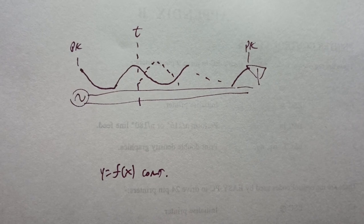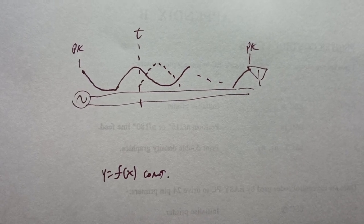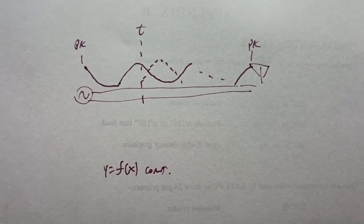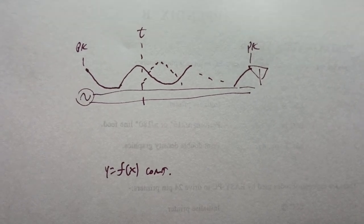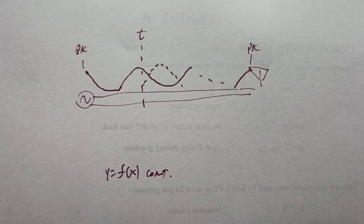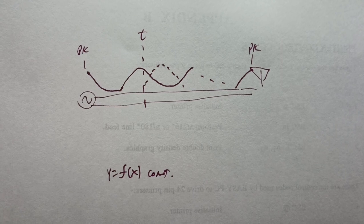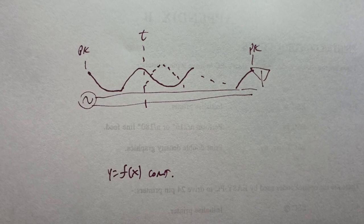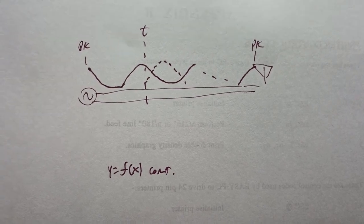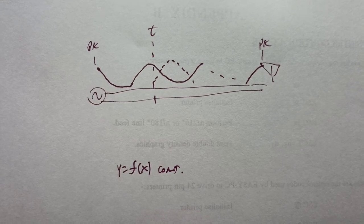But for initially setting an antenna up, it's pretty unlikely that we're going to get it right the very, very first time. And we can use relative measurements like tuning the transmitter up and down to see whether the SWR indicator goes up or down as the frequency goes up or down, as an indication of what to do for lengthening or shortening a wire by frequency. That doesn't tell us necessarily about raising or lowering the antenna for the correct feed point resistive value.